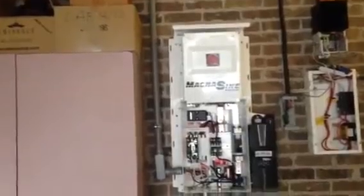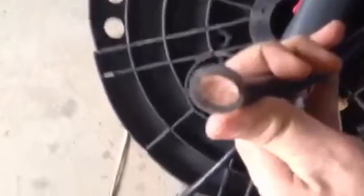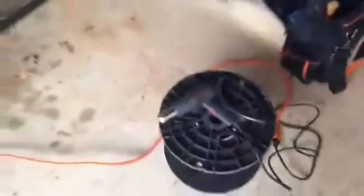Right now I'm just making up some battery cables — got my battery cables getting ready. Heat shrink, nice Panduit lugs, 3/8s for fine-stranded. Using some really nice fine-stranded wire. This is the type of wire I like to use for battery cable. It's a very fine-stranded wire, really nice to work with, and it's also a code-approved wire for running battery cables.